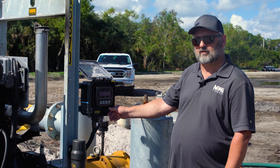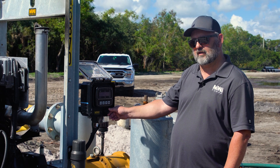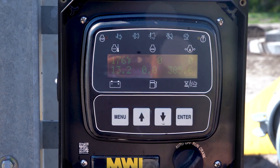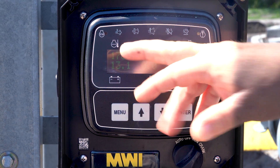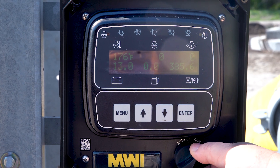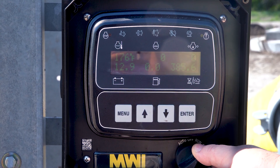We'll speed up to the operating range and monitor the vacuum gauge to make sure the points have primed up and that we're pulling a vacuum. We're going to double-check that all systems are good to go. If there are any dashes on any symbols on the panel, it could be an issue with a sensor. Once we start it up, we'll accelerate up to about 1450 RPMs, and that's going to help us pull a prime and get the system up and pumping.